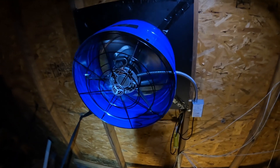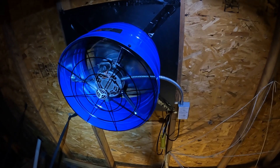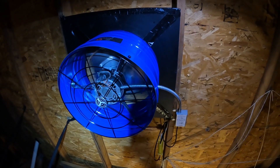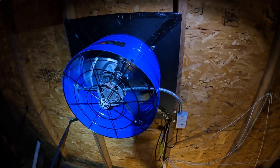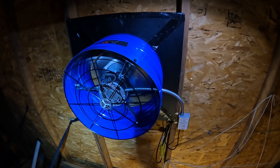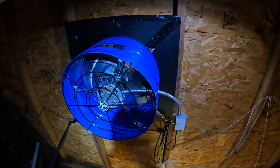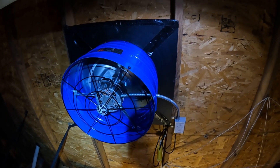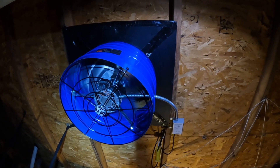I don't want to put it on high — I have a ridge vent so I don't need negative pressure. During a good rainstorm, running too hard could actually pull water in from the ridge vent. So I'm going to have two of these wired on low. It's a lot of work, but also a lot of energy savings and great performance.